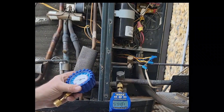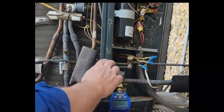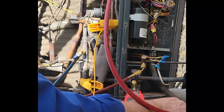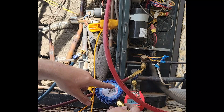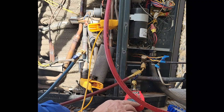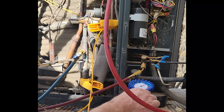So if you touch this, it'd be hot. And if we used our old-fashioned gauge, we could easily blow this gauge because the pressure in this line could be much higher than what the gauge is rated for. Now we're at 288, and notice this gauge only goes to 250 — we're in the overpressure side. So by having my high pressure gauge here, I knew that I'm protected. But what would have happened had I had my low pressure gauge here? It could have damaged it.